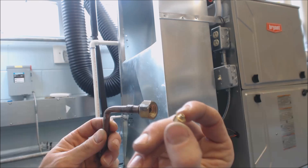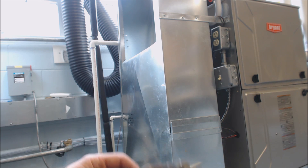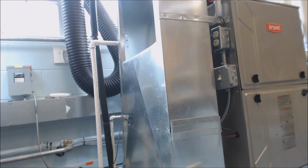This is a little orifice — they come in different sizes. A piston and an orifice are the same thing. If you do not have a TXV, then you know you have a piston. You need to look at the rating plate on the evaporator coil, but the best way to tell is to open up the face of that evaporator coil to verify that there is no TXV before using the superheat charging method.